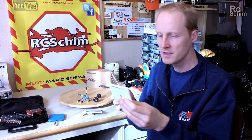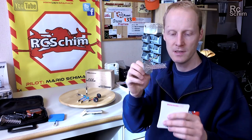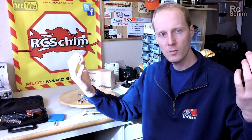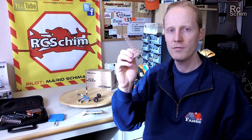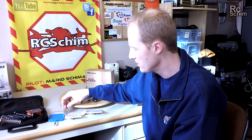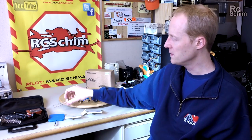I've read about the difference between patch antennas and helical antennas — it's a really complicated matter. Helicals are also directional, but they have lobes on the side, so you do get some range sideways and to the rear. This one here has 12 dBi of gain, which is a bit less than the patch. However, helicals have a more stable receiving strength than patches, at least from what I've read. If you have multi-pathing because of reflections from a long range, helicals will cope better than patches. Even the sharpness of the image and colors depend on antenna quality, and helicals have a bit better quality overall.